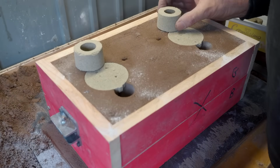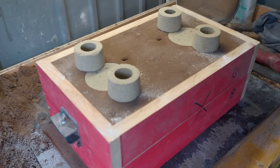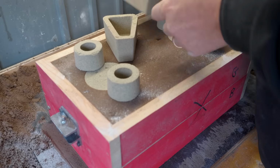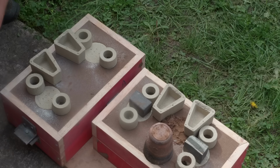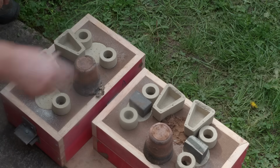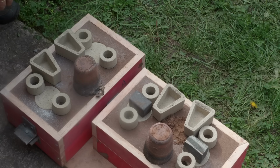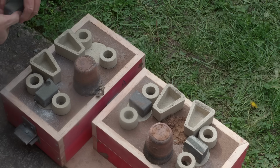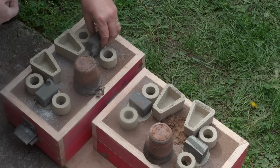Over multiple iterations, it turned out these risers of about 30 millimeters were perfect to give the right head of pressure for the aluminium. It's important to weight down the molds and also these cores. Sand is less dense than aluminium, so it floats on it. It would suck to have the core float off, destroying a casting after all this work.